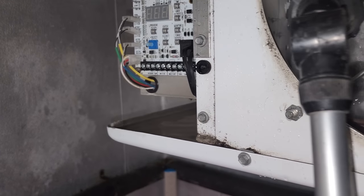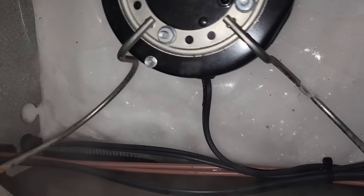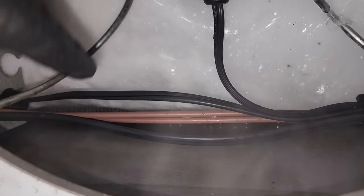I'm going to have to stop right now because it's about to overflow. I'm putting more water than the drain can drain out. So we just stop for a second and let it drain. If you notice it's having issues draining, the ice can be all around the drain and it won't let it drain. So just clear right in the drain area, which is usually right in the middle of the coil.